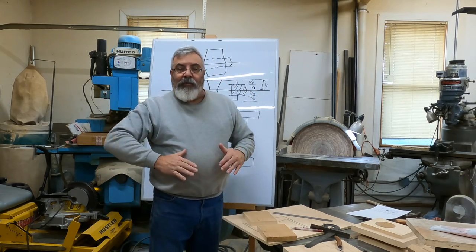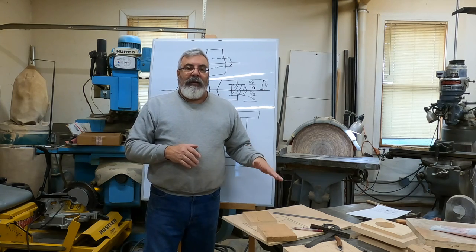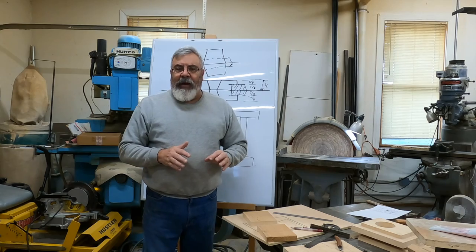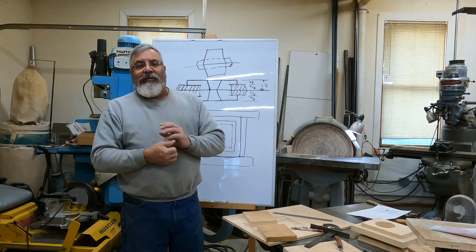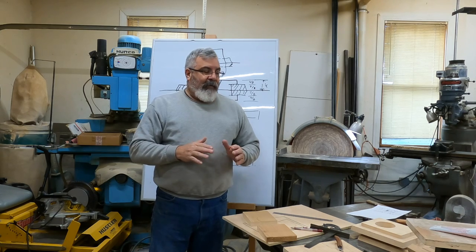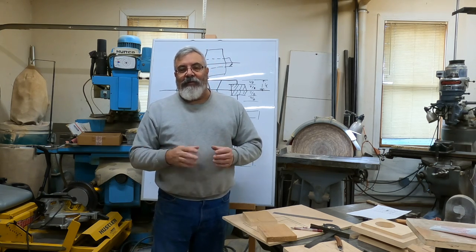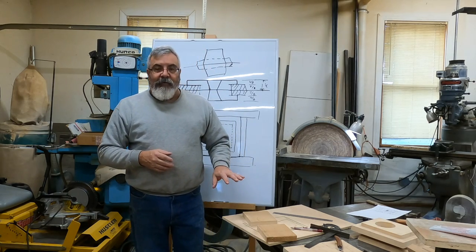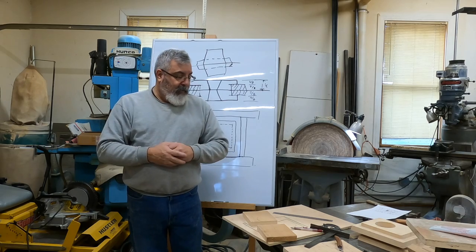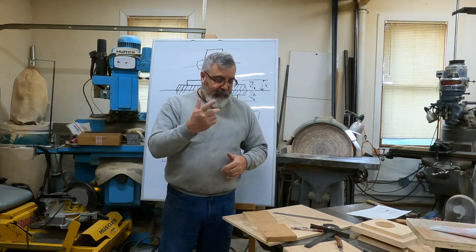So next what I gotta do is determine a draft. I've put 3 degrees on the pattern. This three doesn't matter. I could probably do 3 degrees again, but I noticed that 3 degrees is a little bit little, and there's machining all the way around it, so I could have put 10 degrees, but that just kind of looks a little hokey. I'll probably put a few more degrees on this thing. No big deal. Like I said, it's your thing. There's nothing that calls it out on the drawing, and it wouldn't matter because it's getting machined.